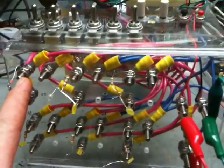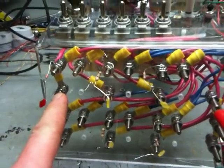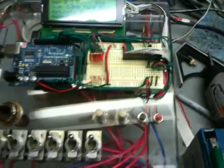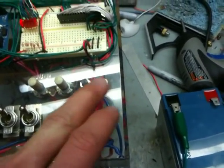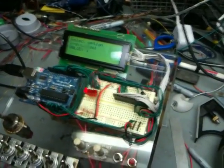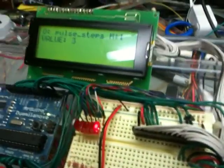At the end of this video I'll show you a little more underneath this thing. Basically here you have a ground connection, a connection to where your coil is, and then on the other side you've got your power. So theoretically you're coming out of ground through your MOSFET to a positive voltage. You've got the Arduino board, an LCD screen, and a little prototyping board so I can easily move wires around. There are two potentiometers for varying the duty cycle and frequency.